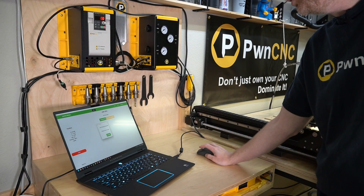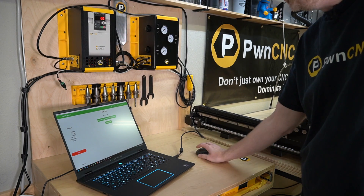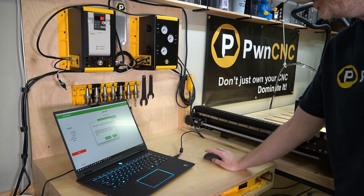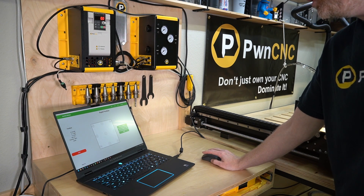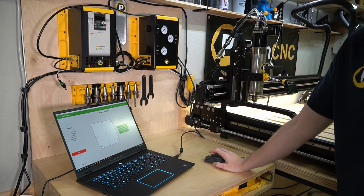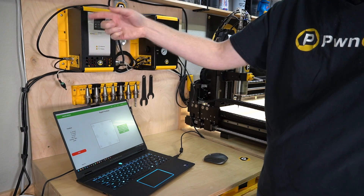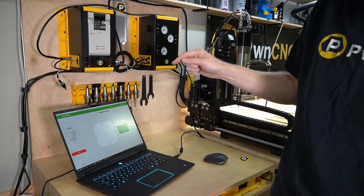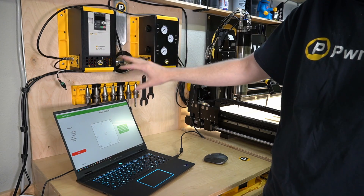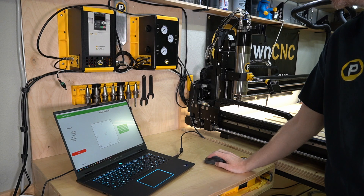We've got a bit in there already, so we're just going to hit Resume and allow it to measure. Our machine's all set up. Now we can run a few tests. Let's jog the machine over here so we can actually see it — Rapid Position, let's jump back to the back northwest corner. It's flipped down to automatic mode, and I've got a special programming — which I'll reference in that video — that will allow you to configure it so that if the voltage gets up on that PWM line to a certain amount, it will automatically start the spindle.